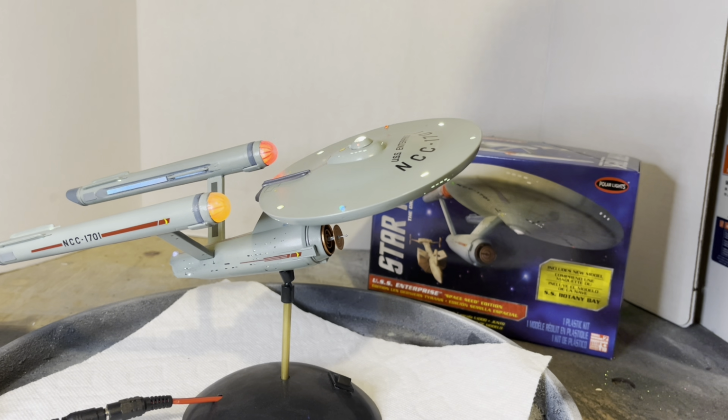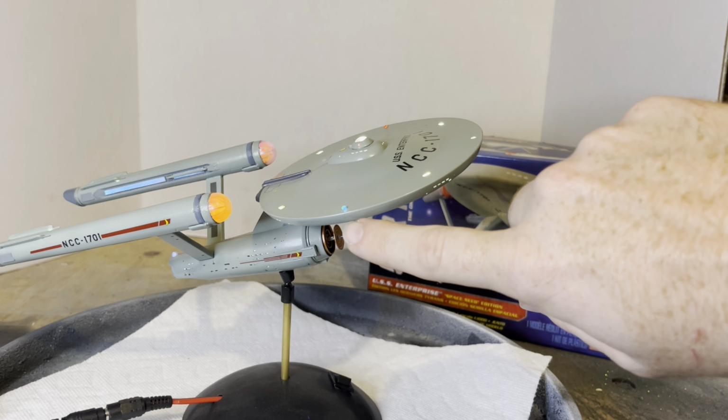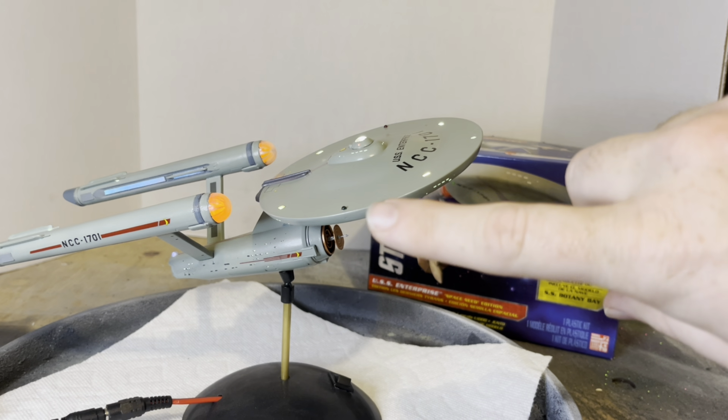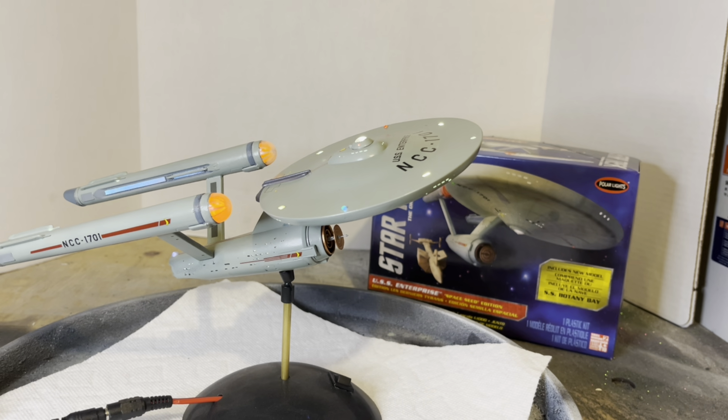Overall, I am very happy with how this model came out. I am happy with how dead on this looks, with few creases here or there. I really wanted to get a nav on the side here. Every time I tried to seal up the sides, the solder resin and everything I used to bond the fiber optics and the SMDs just wouldn't allow it to close, so I had to start cutting it out. And yeah, we ended up with a simpler nav light design, but it still works.